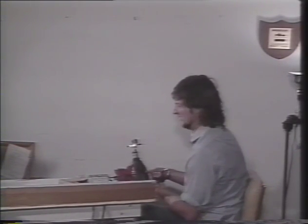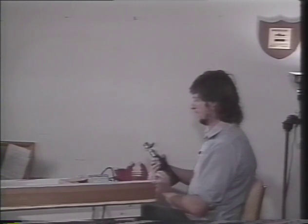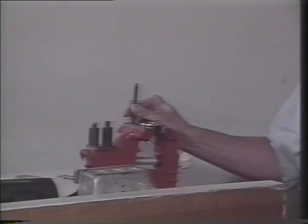Even with this lightweight drill, we can get in, get through the set screw, remove the cylinder from the door, reach in with a screwdriver, and open the locking mechanism. This is a new kit on the market. It's called the breaker kit.